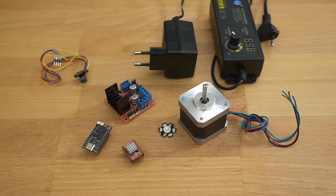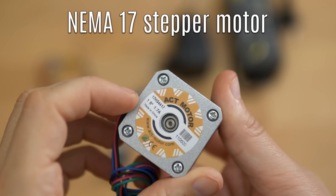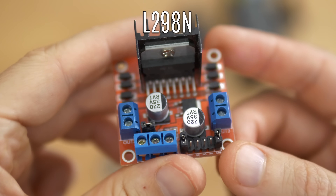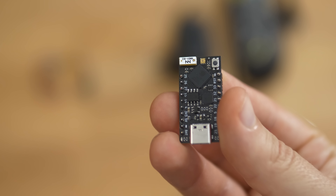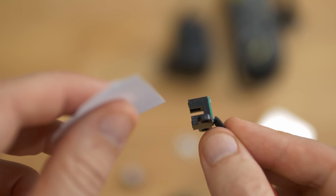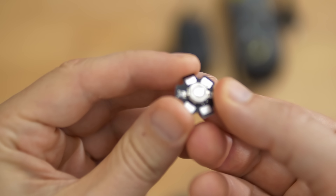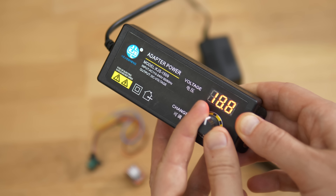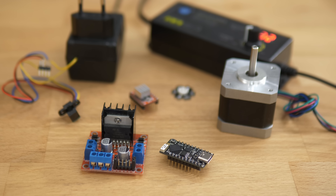To make it work, we need some electronics. To rotate the disc at a precise speed, I'm using a common stepper motor. We also need a driver for the motor and a driver to switch the light. An ESP32 microcontroller with its WiFi capabilities can receive the video signal and control the drivers to display the image. An opto-interruptor is needed to detect the start of an image and control the rotation speed. As a light source, I'm using a high-power LED. We also need two power supplies for the different motor and LED voltages. I linked all the parts, project files and my tools in the description if you want to rebuild it.